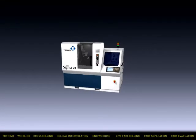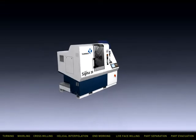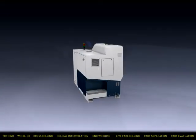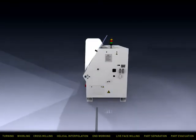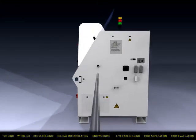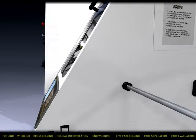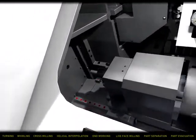Full synchronous rotary guide bushing cooled via circulated oil for rigidity and precision. With Tornos, you can split operations 100% between the front and back spindles for simultaneous machining. In this class, no other Swiss builder provides this capability. One-inch bar stock capability lets you make longer, bigger parts — theoretically, turn a 12-foot bar up to 9 inches in one chucking with a single setup.